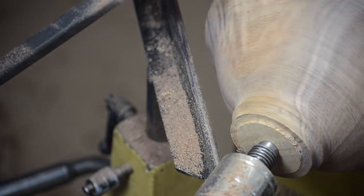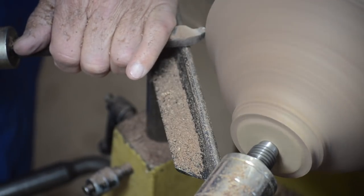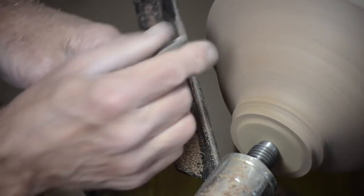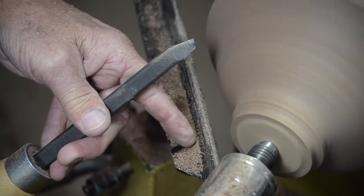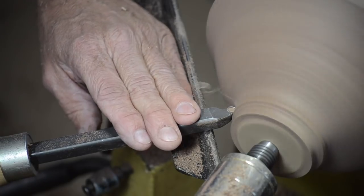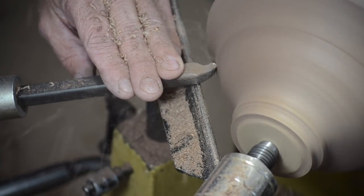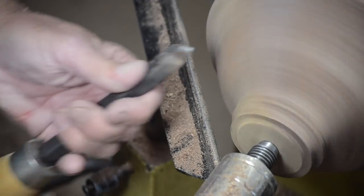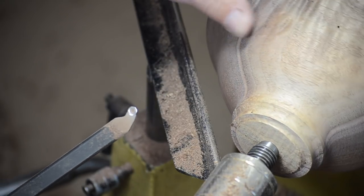The rim is not quite done, but I'm probably going to end up flattening it. One thing you'll probably notice — the cutter is tilted downhill, and that's what allows it to cut as a scraping tool without getting a big catch. You can also use this bevel down here to control the cut — I don't need to be quite as aggressive. The bevel of the tool actually kind of controls the depth if I don't push hard. So I've got a fairly good surface around there now.